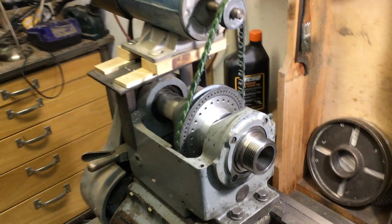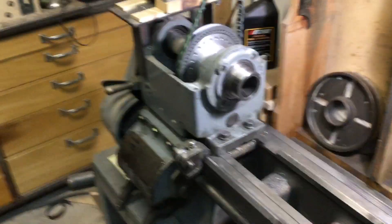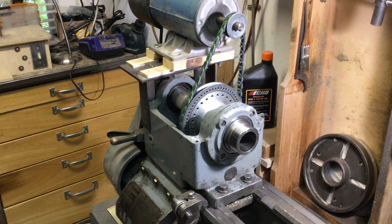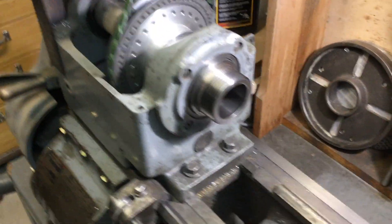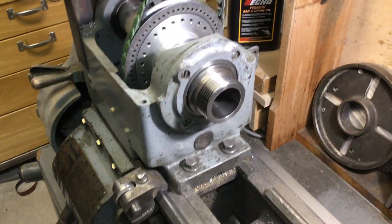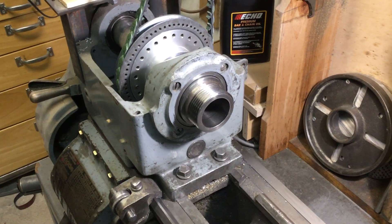It's not the most elegant-looking solution — the belt is exposed — but it's very functional and works quite well. The continuously variable headstock spindle speed is very useful. This video is kind of a preamble: I'm going to take this plate off the front of the headstock to expose the bearing. It has a single ball bearing race at the front — a 50mm ID, 80mm OD ball bearing.